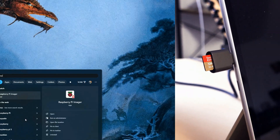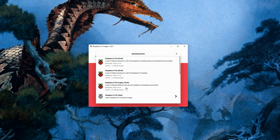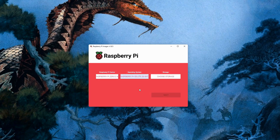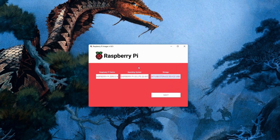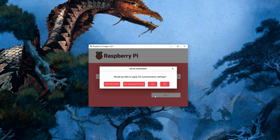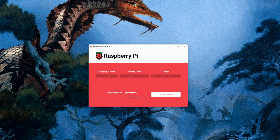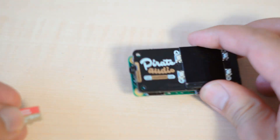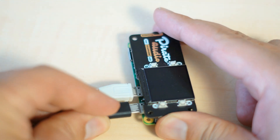Download the Raspberry Pi Imager tool and choose the 32-bit Lite OS. Walk through the assistant and wait until the SD card is ready. In this assistant you can specify which Wi-Fi network the Pi should use and whether or not to use the secure shell login — please do both. Then take the SD card, insert it into the Raspberry Pi, and turn it on by connecting a micro USB cable to its power port.